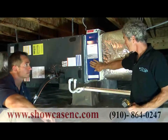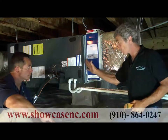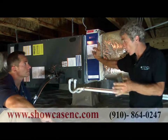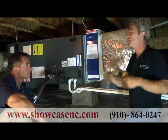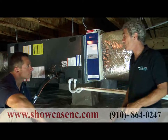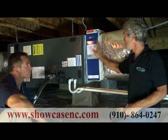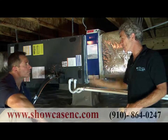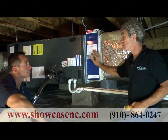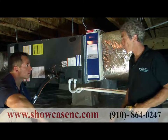One particular thing about this electronic air cleaner: it has an air switch — it only works when air is moving across it. A common question is whether to leave the fan on 'on' or 'auto.' Leaving it on 'on' will filter your air continuously, but the downside is it picks up moisture off the coil and distributes it back into your home. The air cleaner only energizes as air flows across it. This all goes back to sizing — if the unit only runs for five minutes, you're not properly filtering the air in your home. Proper sizing is critical.